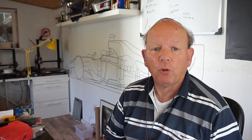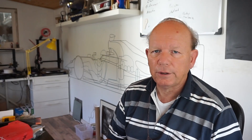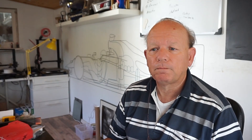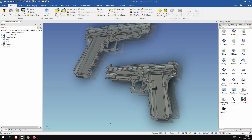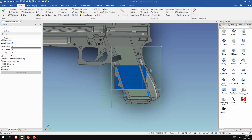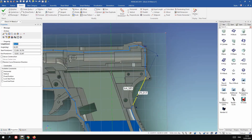Normally when you want to make multiple copies of a part, you make a silicone mold and then cast parts in that mold. But silicone molding material is not easy to get at the moment here in Cyprus. So I've decided to 3D print a mold. I have a good CAD model of a Glock 34, complete with all the internal mechanicals. So if you slice it in half, there are voids and openings, and I need to fill those. Using IronCAD, I'm filling up all the little holes and making sure the filling doesn't stick out through the shell of the Glock.